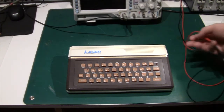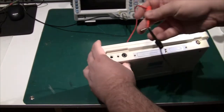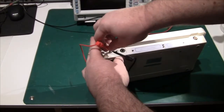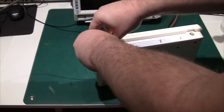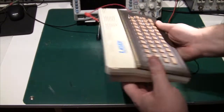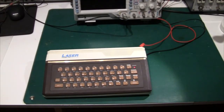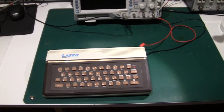This machine needs 9 volts in — there's a standard DC plug down here. I've just connected my benchtop power supply and yeah, there's an LED lit up here. So maybe it's working. Let's have a look at the TV and see whether there's anything. The video seems to be flickering quite badly, but it says Video Technology — VTech Basic 1.2 — and ready.